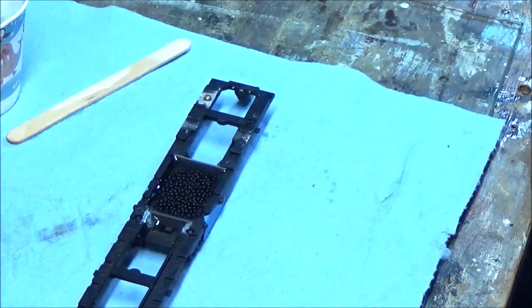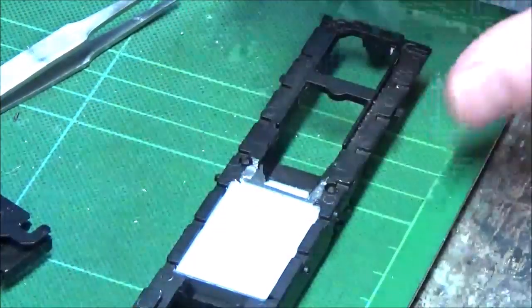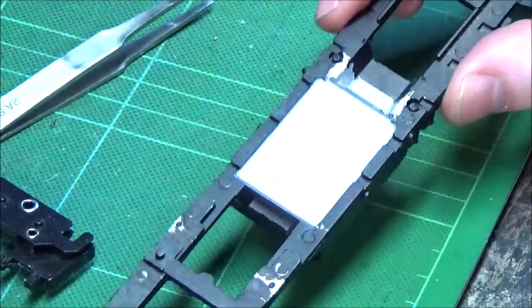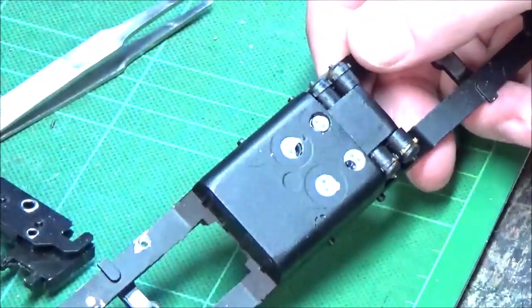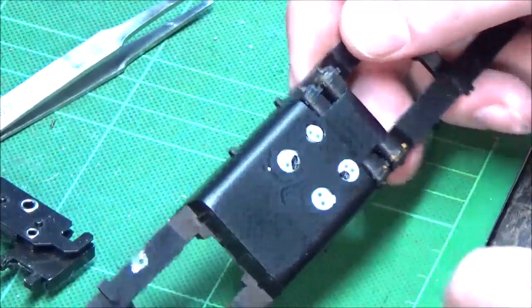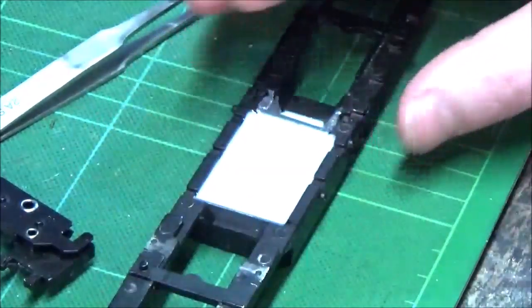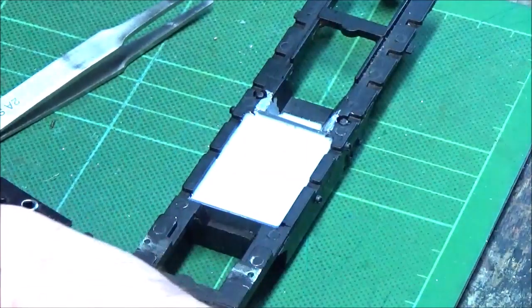it should only take about 5-10 minutes to cure, so we'll be back. Alright, that's just about set up. Still a little tacky, but you really can't see my lead shot very much anymore. Got a couple voids in the bottom, but that'll all lock into the profile of those former motor mount holes. And then I'll have a nice flat area to mount the motor.